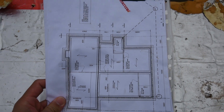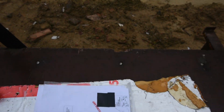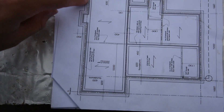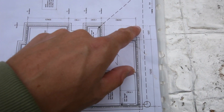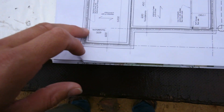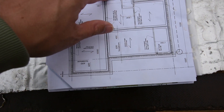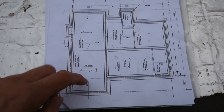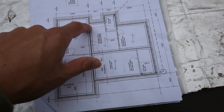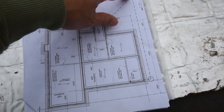As you can see, this is the outlay of the floor plan and this is how it's going to sit. These lines here — down here, across here, up there, and across here — those are the lines that I've set out. So we've got the outside line already set out and ready to go. Now I'm going to set up for all these little in bits and out bits across the fireplace, so we're going to set a few more lines up to compensate for that movement.